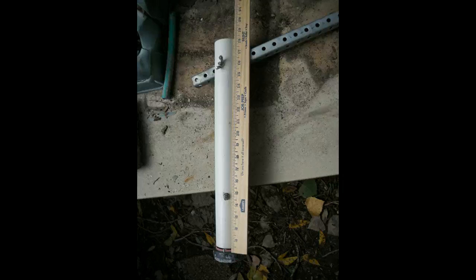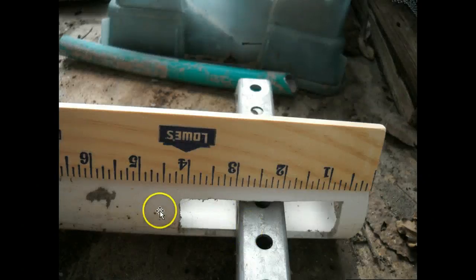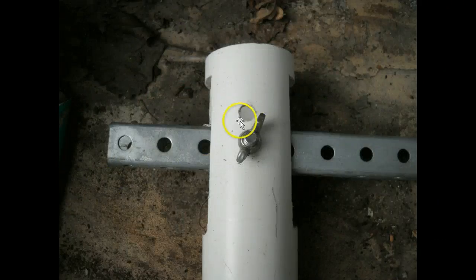The next part is the plunger — the thing that's going to push the clay through your extruder. It's got two parts: a piece of 2-inch PVC which fits inside the 3-inch, about 18 inches long, and a box beam — a hollow square beam of steel with holes drilled in it, available at the metal section of a hardware store, 36 inches long. You want it fairly long for good leverage. I cut a slot through the plunger about four inches long to insert the handle, leaving the top intact for extra support. To attach the handle to the plunger, I just use a carriage bolt and a wing nut.